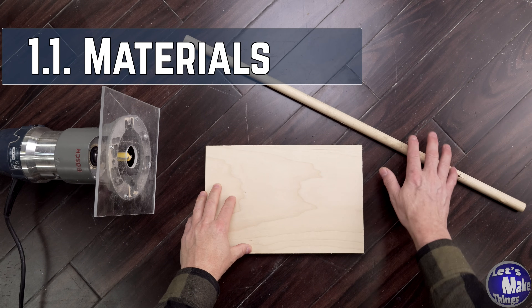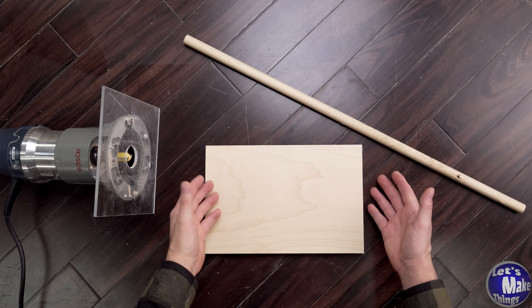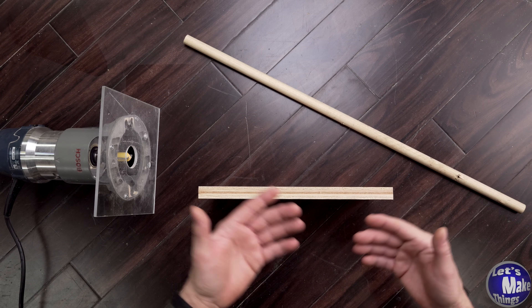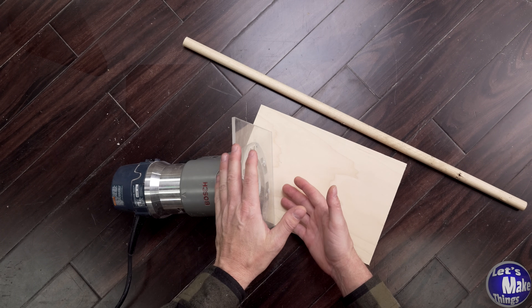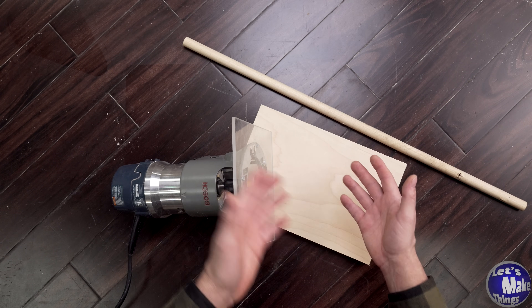To make this, all you need is a piece of plywood and a dowel. Super simple, but because we are using a dowel as a handle, you'll want to make sure that your plywood is at least three quarters of an inch thick. That extra thickness makes sure the dowel has enough surface area for a strong glue bond, keeping everything solid. And of course, you'll need your plexiglass base already attached to your router. If you haven't done that yet, I've got a quick method for it on my website — link in the description.